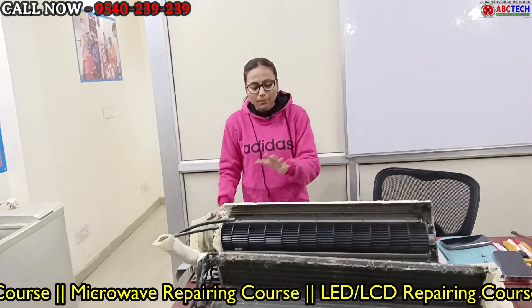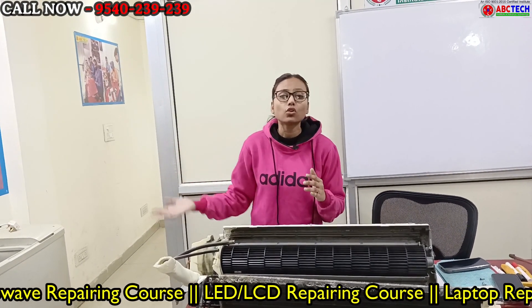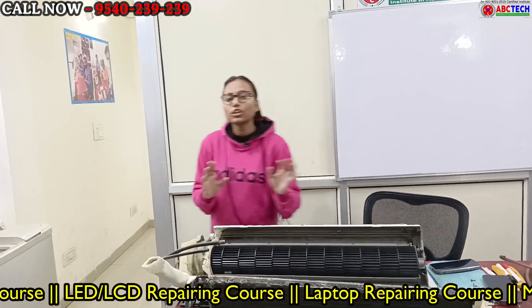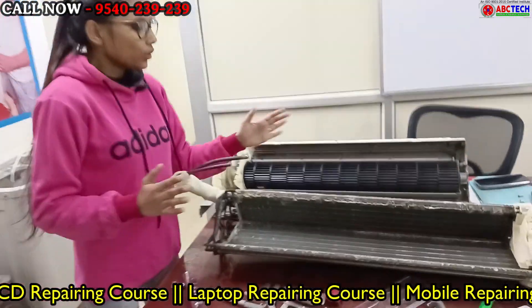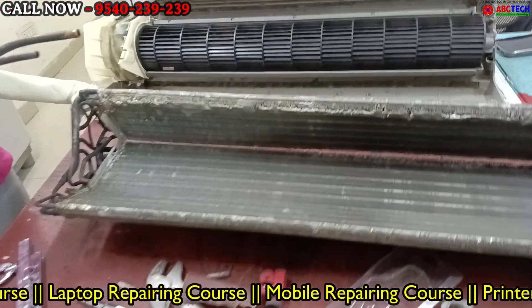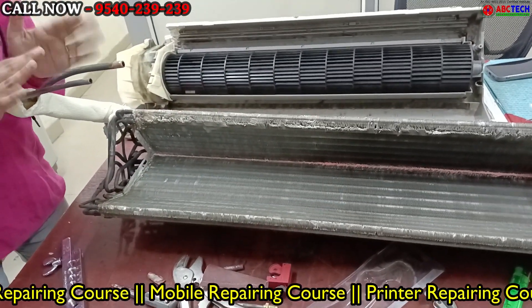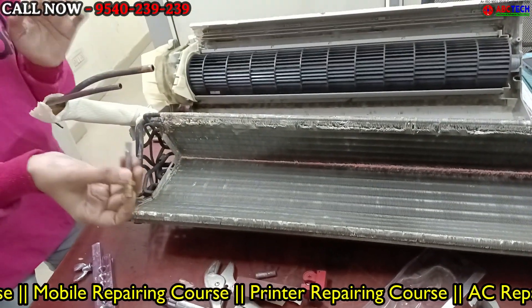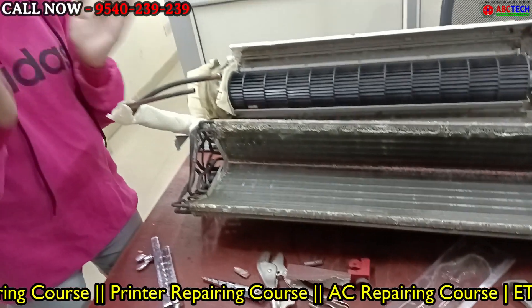You will see the explanation inside the video. We have already disassembled the unit because the video would be too long otherwise — we have already made a separate video for that. So in today's video, we will see how to fit the pin valve. The unit is disassembled and you can see the cooling coil area. We have already removed it. Now you will see the two lines: the suction line and the liquid line. We can see the pin valve here. We have already removed the pin valve. So what we do here is fit the pin valve, pinch the tube, and then give pressure.